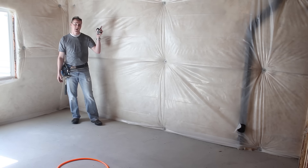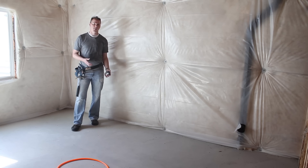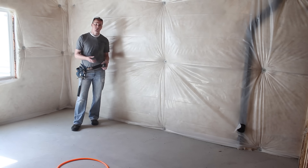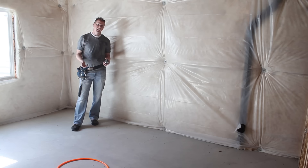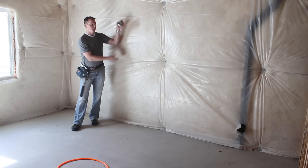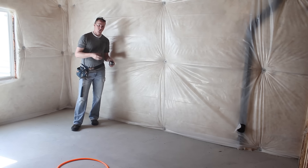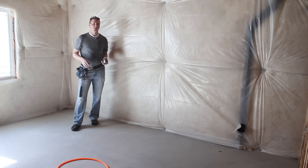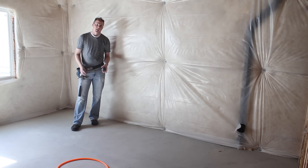We've got our cross-members in place now, and the next part is to actually get this wall built. There are two schools of thought on how to do this. If you have the space on your floor, one of the easier ways is to actually build the wall out on the floor — you can drive the nails through the bottom plate and top plate and into the studs. You just measure everything, lay it out on the floor, get all your boards cut, tack it together, and erect it in place. Then you can tack the top and run your Ramset nails through the bottom. The other method is to put the top plate up, put the bottom plate down, and then put each stud in individually. Where we can, I like to construct the wall on the floor.